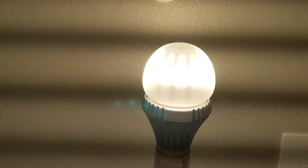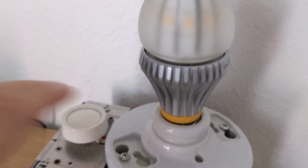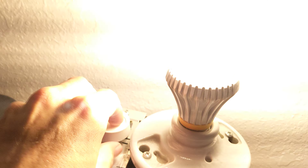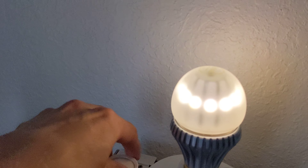Let's go to a normal dimmer and see how this bulb performs. Here's the Switch 3-Way in a dimmer — I have no idea how this will perform. It has a little buzz to it, and you can see this pattern on the camera. It has an audible buzz and a flicker — flickering at about 60 hertz. Flicker stops, then there's more flicker, and then it dims down like that. It really does not work very well in a dimmer.